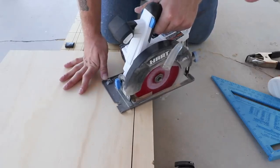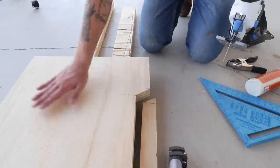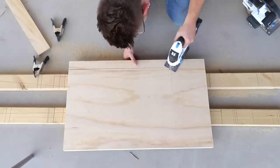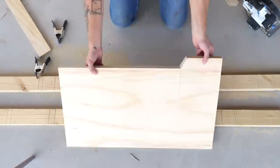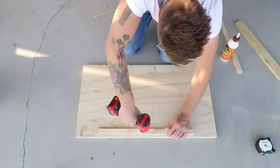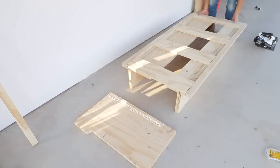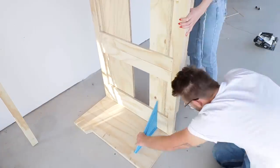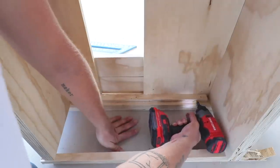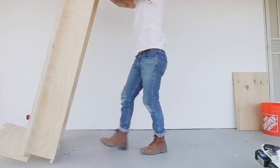On shortcuts like this I prefer to establish my line using the circular saw because I get less blade deflection, even though I still need to come back with the jigsaw to trim that little bit of material left in the corners. Wood glue is crazy strong — that's what's giving this sofa the majority of its structural integrity. I attached a simple ledge onto the inside of the arm as a positive stop for the base to latch onto. This helps line everything up and gives me material to bite onto with screws. I screwed from both sides to get really good clamping pressure, which allows the glue to have a really strong hold.